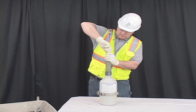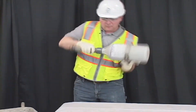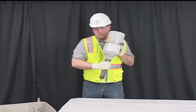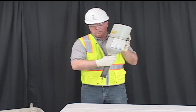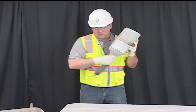Attach and tighten the cap, producing a watertight seal. Quickly invert the meter, shake the base, and return the meter to the upright position. Do not invert the meter for more than five seconds at a time, repeating this process for a minimum of 45 seconds. This shaking procedure should loosen the concrete free in the bowl.